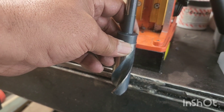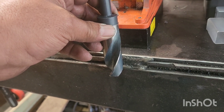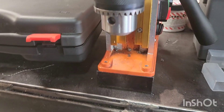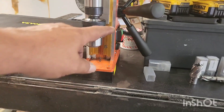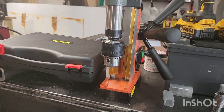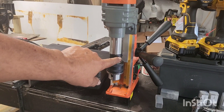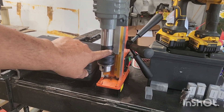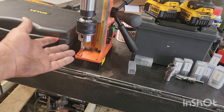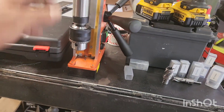A drill bit takes up most of the travel, so to get this thing up in there you'd have to take it off the truck and redo it. If you need to change bits — say you're stuck on a bit or something — you need to take the magnet off, put another bit in. You usually just go with the right size bit, but with the truck frame in there it makes it even shorter. If you're stuck or drilling through something, it just doesn't work. So if you have the option to buy this mag drill, don't go with the automatic or quick-change — it's just not worth it.